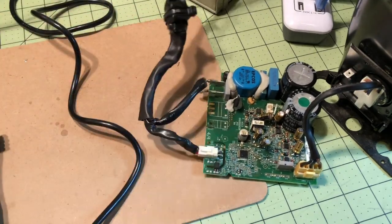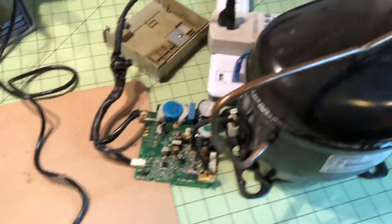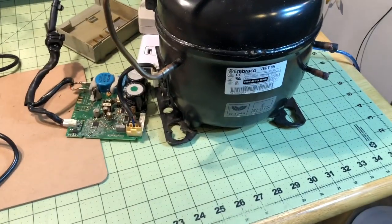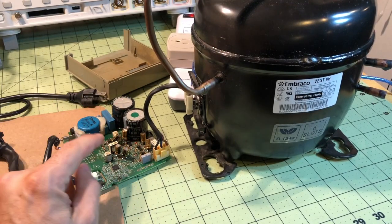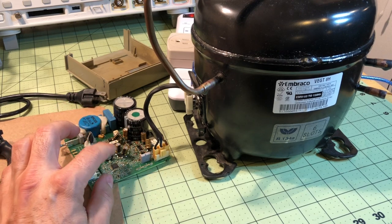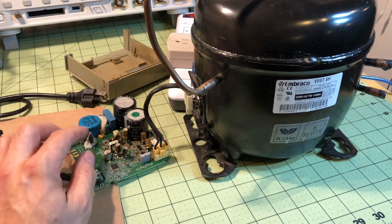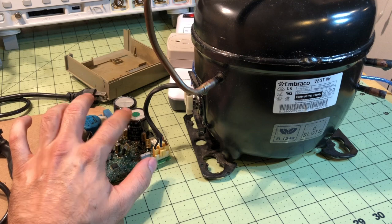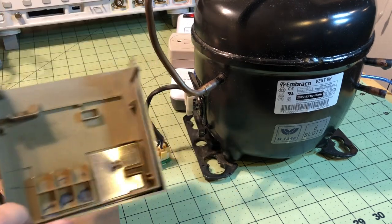So I'm just going to plug it straight into the power — 120 volts. And there it goes. Alright, so on every one that I've opened so far, I've found all these 33 microfarad at 25 volt capacitors to be defective. That's not the only way that this inverter can go bad — on one of the ones I've seen, one of these brute force electrolytic caps had busted from the bottom and leaked electrolytic fluid all over the cover.